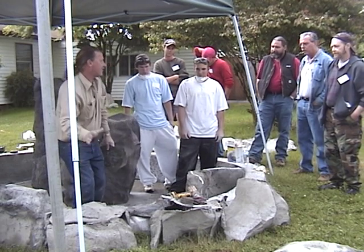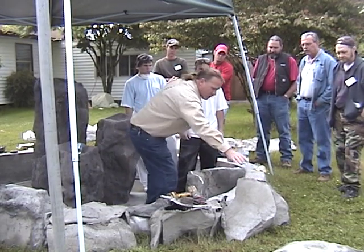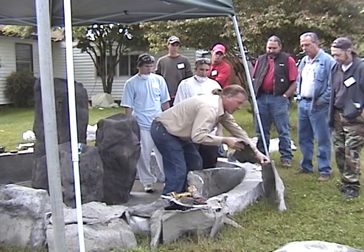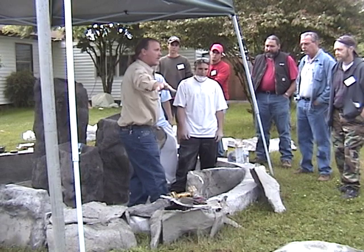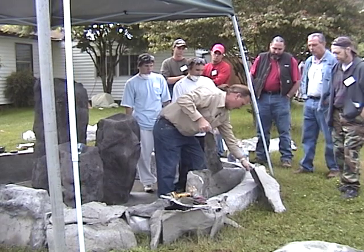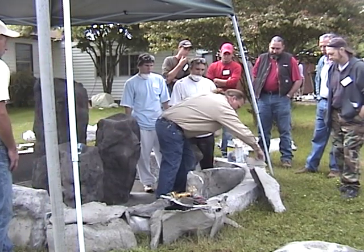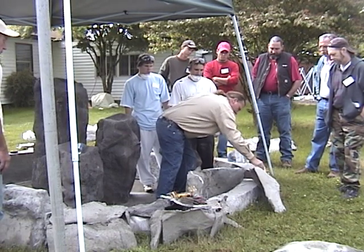On the top, there's a three-inch inside — you'd basically just set this like you do a tile: mortar some mud down there, stick it down, and you'd be done. I'm more inclined to use this little piece right here. I always keep my pieces library in front of me, from the littlest to the medium to the big ones, and I choose the appropriate piece that won't need much cutting. I want to find a piece that basically fills that little area, then span it with a full piece — that one looks like it might just work.